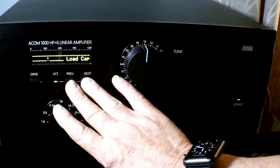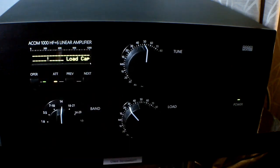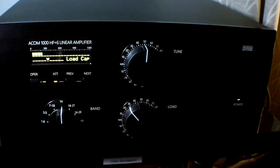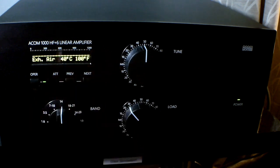It's protected from just about anything you could throw at it. As one reviewer put on eHam, you'd have to take a hammer to damage the amplifier because you certainly won't damage it in day to day operation. It's very easy to tune with the true resistance indicator on the screen — it puts a little exclamation point in the center and you simply adjust your load control to center a little triangle, and once that triangle is centered your load control is correct. You then tune your tune control for maximum output and you're good to go. It has a 6dB attenuator which you can switch in to lower your drive without having to touch your radio.